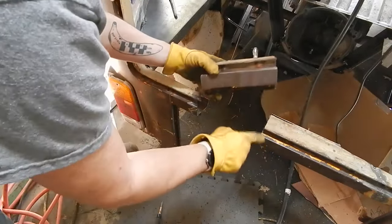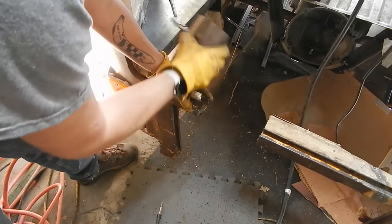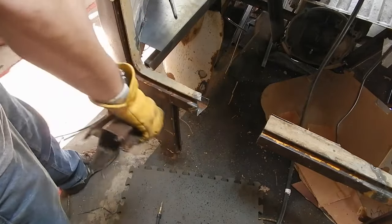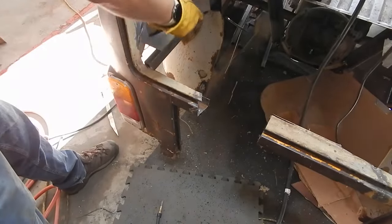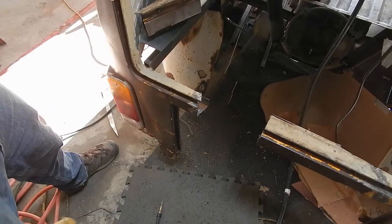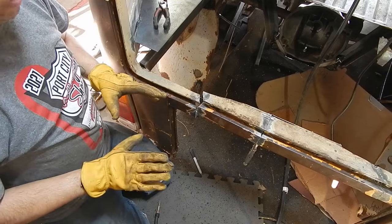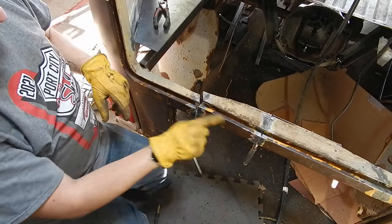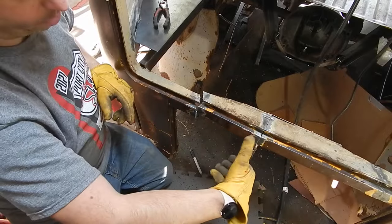I think I'll weld it on this side because it'll be an easy cut. And then I'll pull these two together. If I have to break this weld and those two tacks, it might work. Nice. So here we are. Kind of knew this would happen. Kind of planned for it. Straight line means way too tall, but that just means that that's twisted in a little bit.